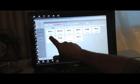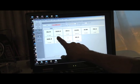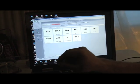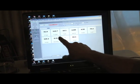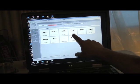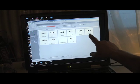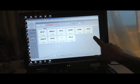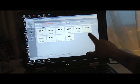So we have the temperature: ambient temperature, 82 degrees; stack temperature, and that's at the location of the stack probe, which is just above the top of the heater, 310 degrees; percent oxygen, parts per million CO, percent CO2. This gives us an instantaneous idea of the efficiency as well. So 74%.